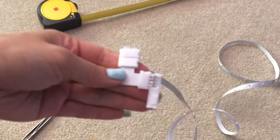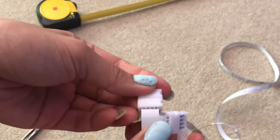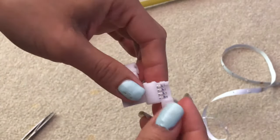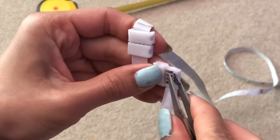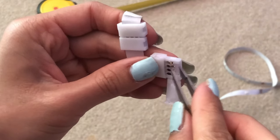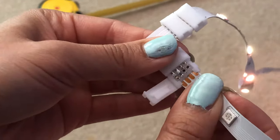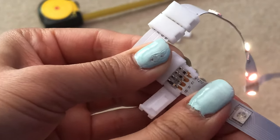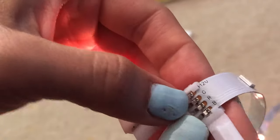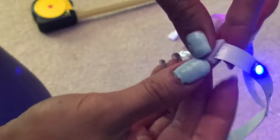Now be careful on this part — we are going to connect the corner connectors to each strip of LED lights. I messed up a few times because I didn't know how to open the connectors and placed the strip on the wrong side, but I eventually figured it out. First, make sure you have the right corner, open up the slot, and try to open the four silver lines just a little bit. I use tweezers to open them up and slide the strip in with the golden inserts on the outside so the silver lines will land on top. Make sure you're sliding it in real good, then push the silver lines down, close the corner connectors making sure it locks everything in place — and voila, it works!